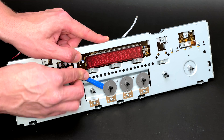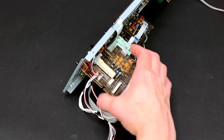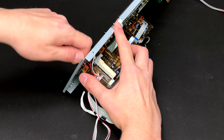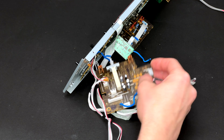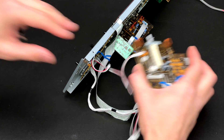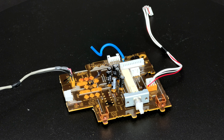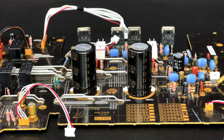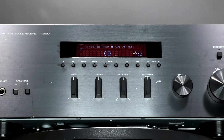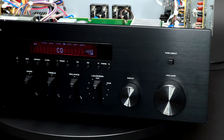The sub-chassis unit consists of a lot of different elements. I will start by removing operation PCB 2, which accommodates the pure direct switch — just have to remember to disconnect the cable which links it with a tiny LED indicator PCB. After the audio signal leaves the pre-amplifier section, it passes through this board on the way to the power amplifier. This switch gives you an option to bypass loudness, balance and tone control, leaving the signal as close to original as possible — that's why it is called pure direct.